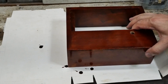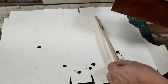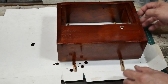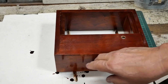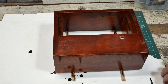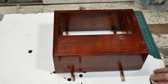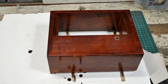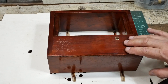I'm umming and ahhing a bit about what to do — I think I have to try and rub it down and start again. What went wrong is that I had it sitting on the bench on a couple of things, which in hindsight was really dopey because I couldn't see what I was doing around the back — that's where the missed bit came in. Also the box isn't heavy enough to resist the movement of the brush with the stickiness of the varnish, so it was moving around. And the last thing I did wrong was to use the wrong brush — I thought I'd use a disposable brush for just coat one, but the brush was completely inappropriate. I think I'm going to rub it down and see if I can improve on it.